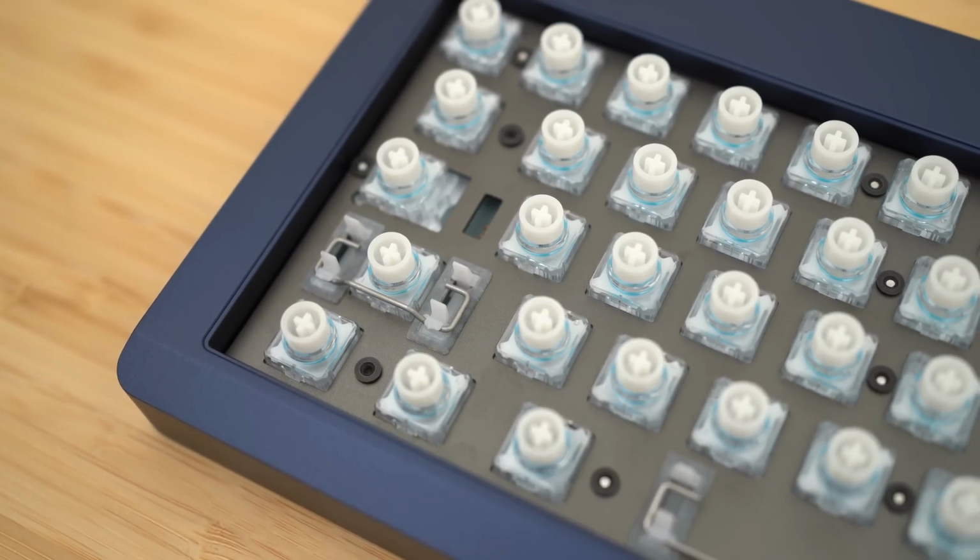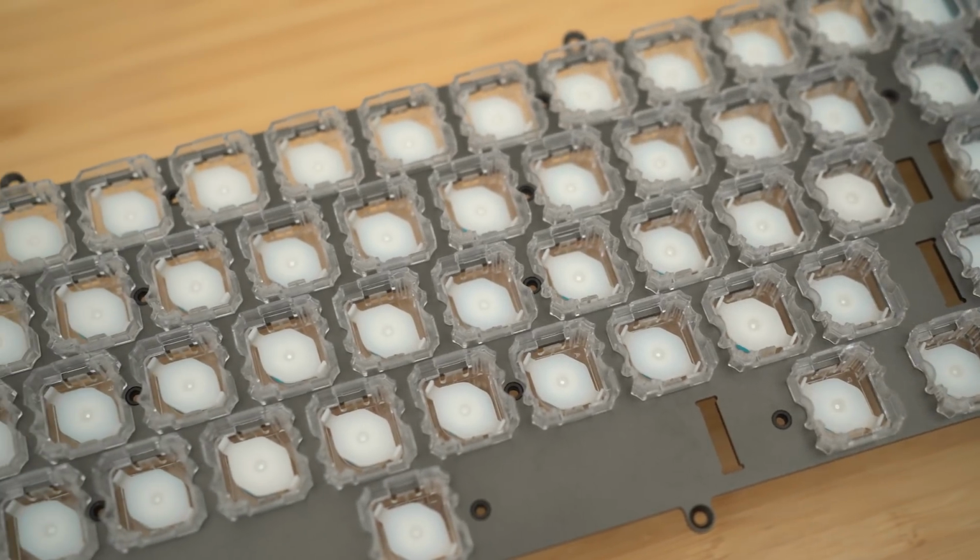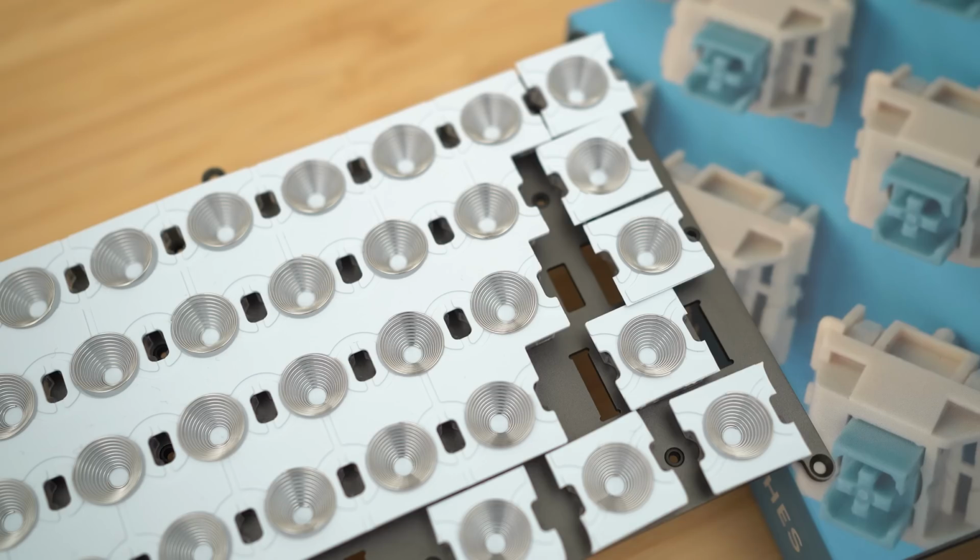This is Scott K. While most of the market is pretty much the standard mechanical Cherry MX switch and its variants, a Japanese company called Topre offers a very different type of switch for a very different type of typing experience. It's this, the Topre Electro Capacitive switch. While some of us may think that Topre is essentially just a standard membrane kind of switch, you have to see them as a hybrid. It has both the membrane as well as some mechanical components to it.